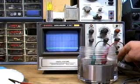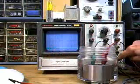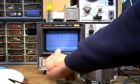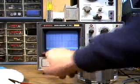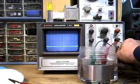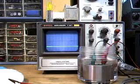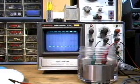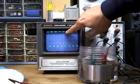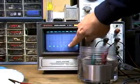The scope is on the 2 volt per division scale, and with the input grounded, the output, or the base reference, is 0 volts right here. When I turn it to DC, you'll see it jumps almost 2 volts. I'm going to say right now it's about 1.5 volts. When I turn the pulse width modulator on, I'm pulsing it up to about 14 volts. The settling voltage is about 2 volts.